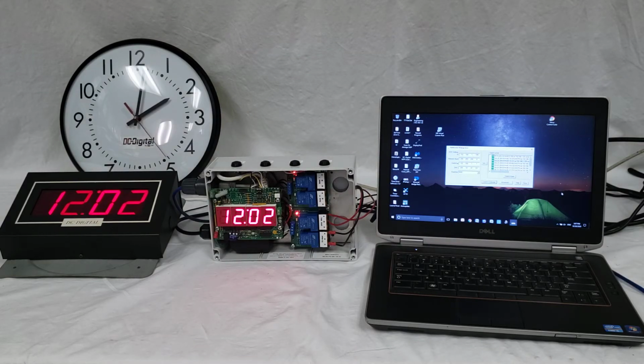DC-10N-CLK-59-12RM2. In this video, I'm going to go over how to use this product first and then follow up with hardware and features. So this is going to be used as a time of day network clock with 2 zone relays and a CLK module that controls a 59th minute reset relay and a 12-hour reset relay. And for the 59th minute reset,